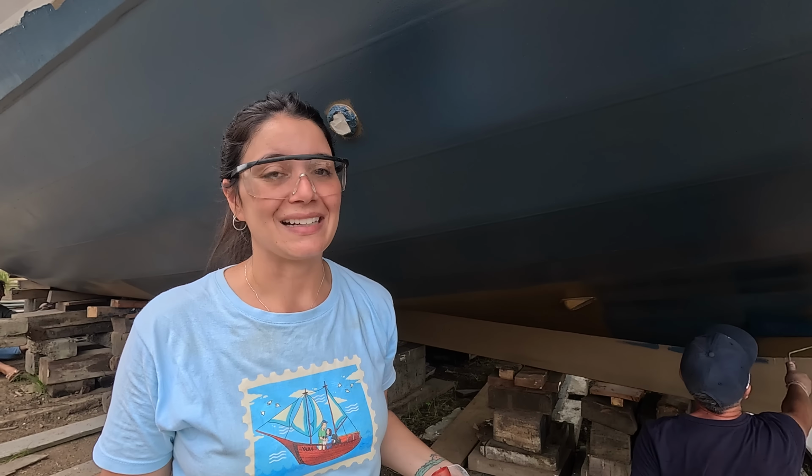So this way the exhaust is in a slight decline downwards, so water has to climb in it, if you see what I mean. Even though we have a muffler and a siphon and stuff, this is going to be it. And this water line should be a little bit high. It's all working on our side. And if that doesn't work, we'll invent something else inside the boat.